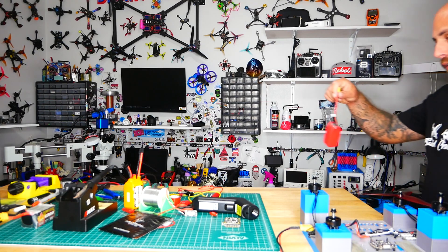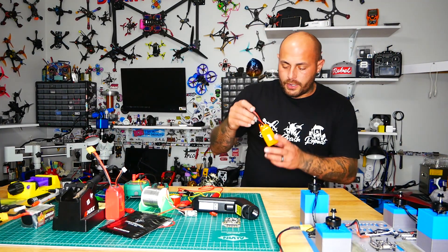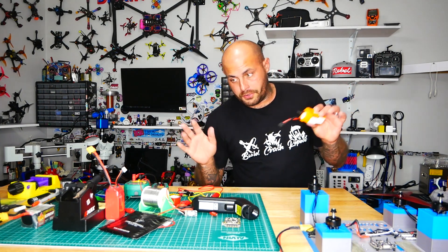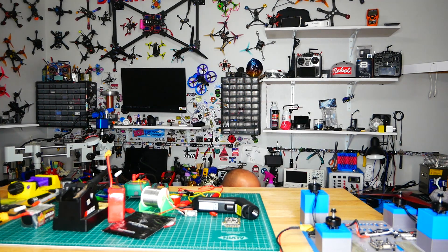43 amps — that's pretty impressive on a 25 amp single ESC on 4S. The ESC torture chamber is doing its job, but so is the ESC. We've tortured it and it still wants to go. So we are going to take off this five-inch propeller and over-prop it with a seven-inch propeller. Look at that — that is a monster propeller. You should not be putting this size propeller on this size motor. We also need a 120C battery. Wrong battery — one sec.